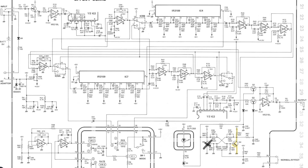So we've determined the LED is off and the pedal is in the off position. The wet signal comes out here and goes into JFET Q3, which acts like a switch to turn the wet signal on and off. Since the pedal is off, Q3 should be turned off. JFET Q2 goes into the input buffer - here's your input coming into the pedal, through the buffer and out of the op amp. This JFET controls the dry signal. Since the pedal is off, Q2 should be turned on and letting the dry signal through, while Q3 blocks the wet signal.